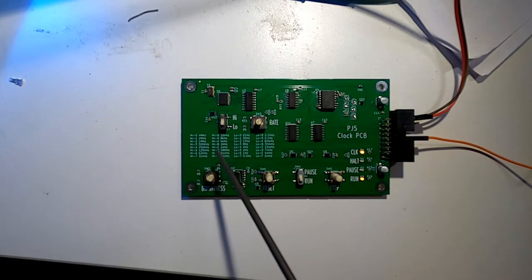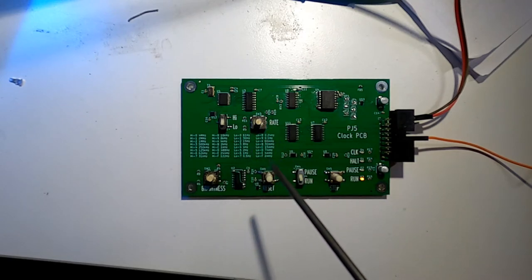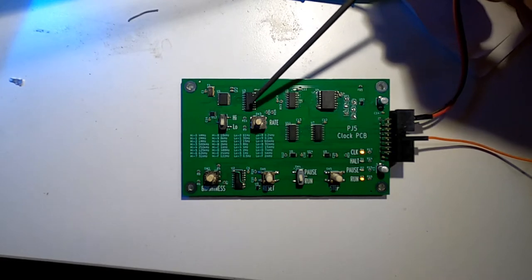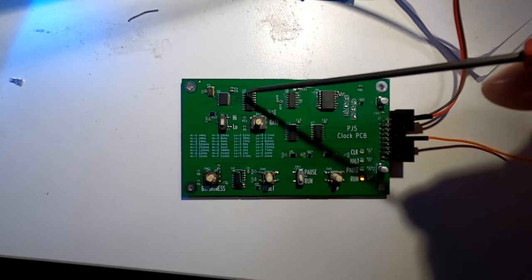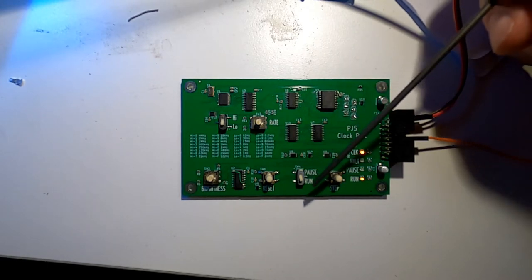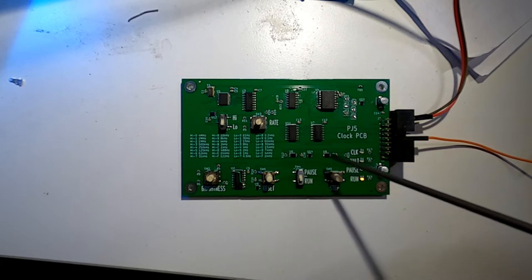We've got a high-low switch to switch between one of the banks. This switch goes from 0 through to F. It's a 4-bit binary counter. That controls one of the other bits. There is an 8-to-1 mux chip here, and the lower 3 bits of this select which one of the 8 lines coming in goes out. That then goes into a little bit of logic to deal with our pause run command, which I'll go into in a minute.